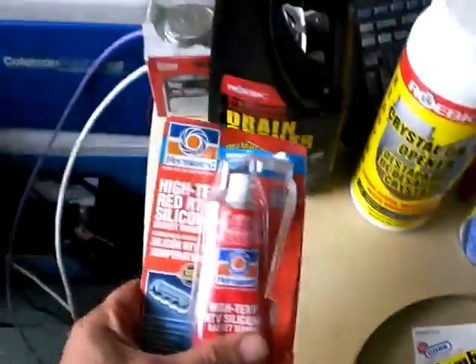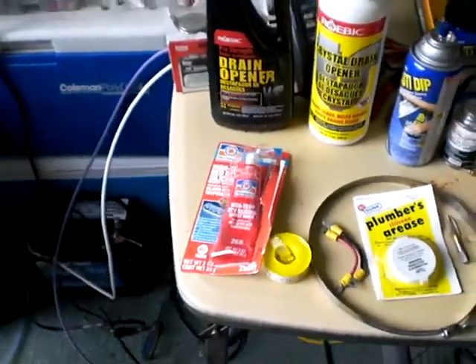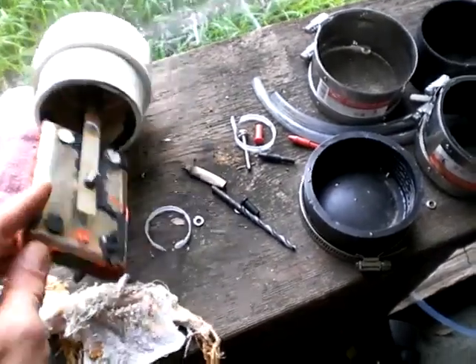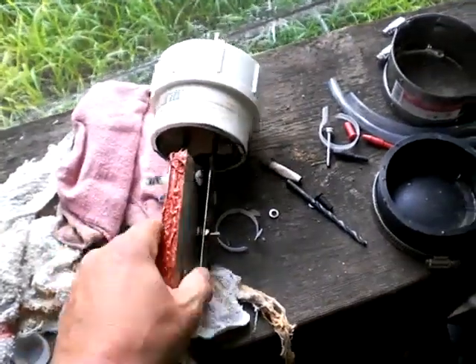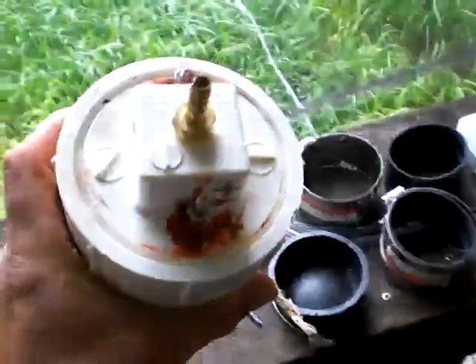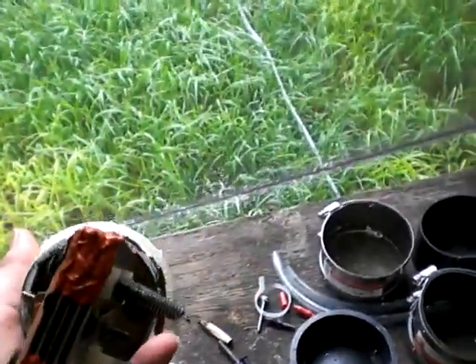Red silicone, the high-temp stuff — I don't like this stuff. It's so sticky, no matter what you do it's always going to leave a drip going from one place to another. One thing you don't want to do is have it inside your cells like I did right here. The intent was I was covering this up with plastic dip to protect it from the solution. It's going to be relegated to just sealing the outside of the terminals; I won't be putting any on the inside like I did on this one.